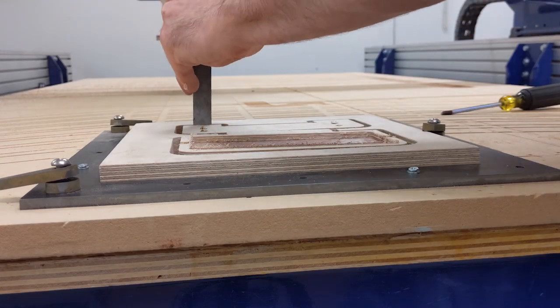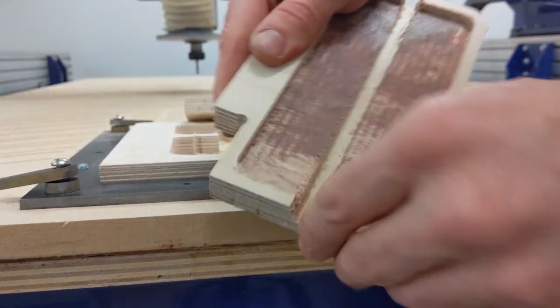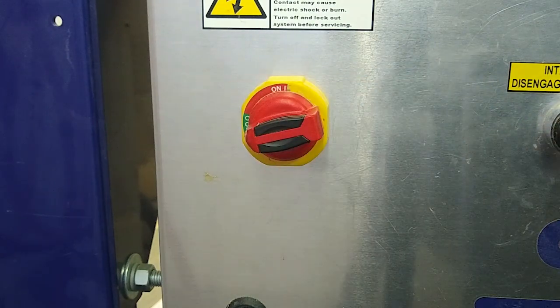Once you're done, use a chisel and hammer to gently break the composite nails holding your parts to the bed, or a drill to remove your screws, and make sure you leave the space cleaner than you found it. If any composite nail bits are sticking up even a fraction of an inch, it can cause huge issues in the next user's tolerancing — so use a putty knife to make sure the spoilboard is as flat as possible. If it seems very damaged, let a design specialist know and we'll run a facing operation. Log off the computer, and if no one is in line behind you, rotate the red knob to turn off the machine. Please let us know if you have any questions about the PRS Alpha 96-48, and we look forward to seeing you in the Makerspace.